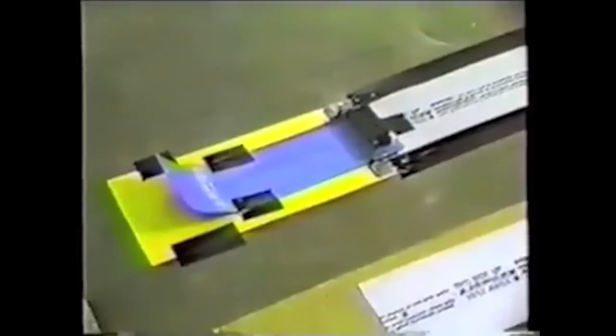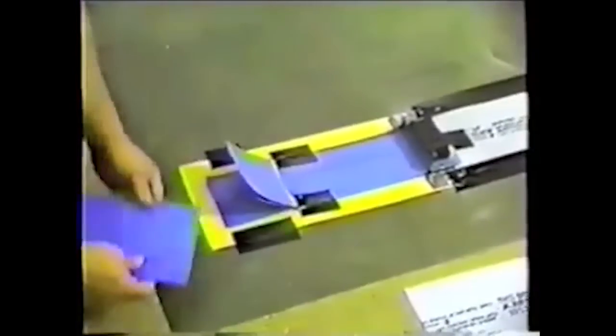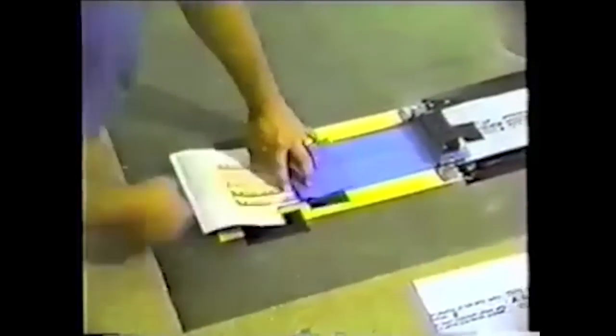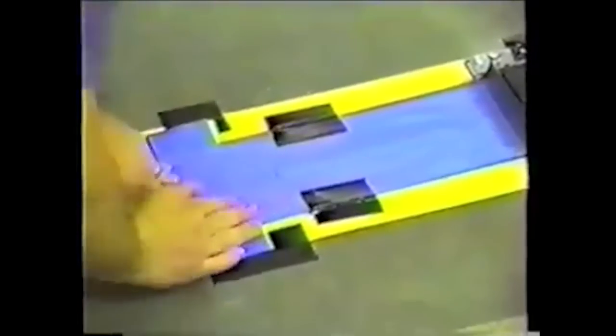If the end of the cable installation is not terminated to a floor fitting, an insulator patch can be cut in half and must be installed over the new terminated cable end, insulating the exposed conductors from the metal top shield. Install the insulator patch between the upper and lower protective blue vinyl. Overlap the top blue vinyl on top of the insulator patch.